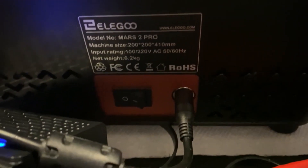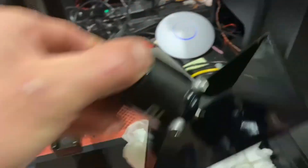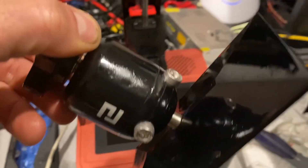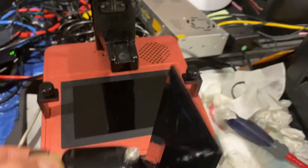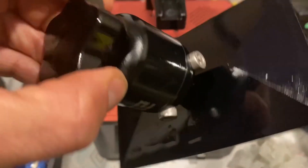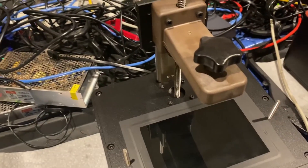The Mars is metal and has a metal plate. It has the pivoting mechanism that the Photon did, and I was kind of happy to get away from that with the Epax X1. The Epax didn't go out of alignment like these pivoting systems do. When I pry parts off, I put it down and pop off the parts, and that sort of levers on this mechanism. They did a pretty good job beefing it up with big screws, but it's still gone out of alignment for me.